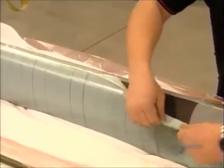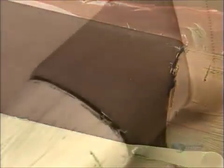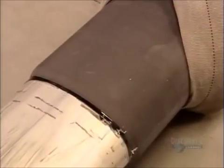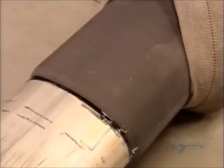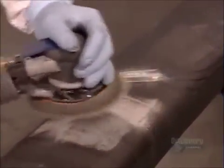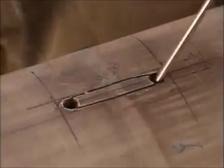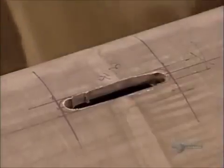Back to the mast. They pull the big aluminum mold out of the mast tube. Using a disk sander, they rough up the surface so paint will stick. They drill two holes, and using a jigsaw with a special blade, they connect them, making one wide slot.